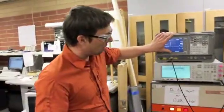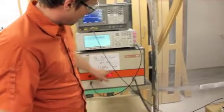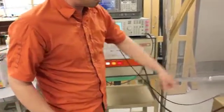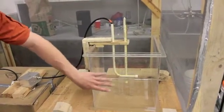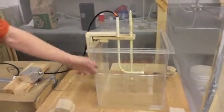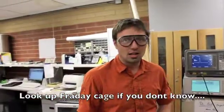But now we have our negative 15 dB difference, and our power is going forward. It's coming out of the amplifier through the dual directional coupler into the matching network through the antenna. And right now this antenna's emitting like crazy because we don't have water around it to insulate it. So all good fun. We really should have the door to the Faraday cage over it, and that would protect us if there wasn't water around that.